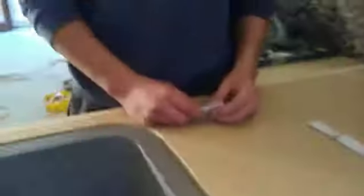So over on this side, just looking at this, we see countertop lipping up. So what we're going to do is add a couple shims to it. And this is all you really need to do. Gets a little awkward. So you want to place your shim in there and run another to the middle. Right, and then we'll run one more at the end. Okay, and take that one and we'll put it behind me.